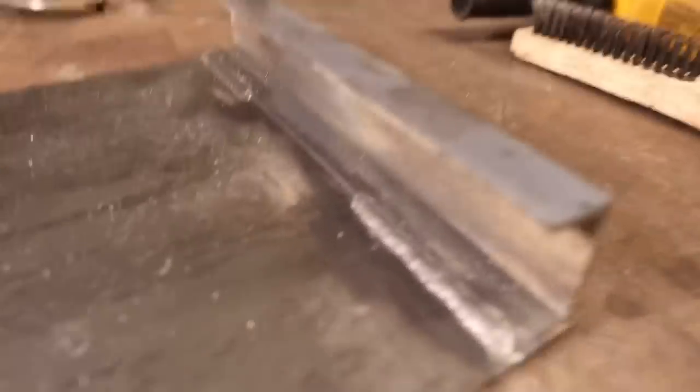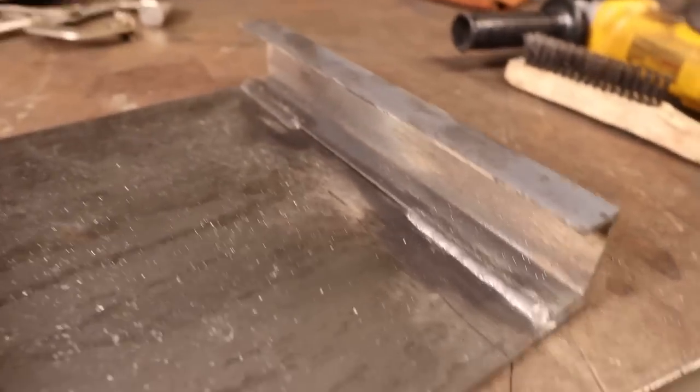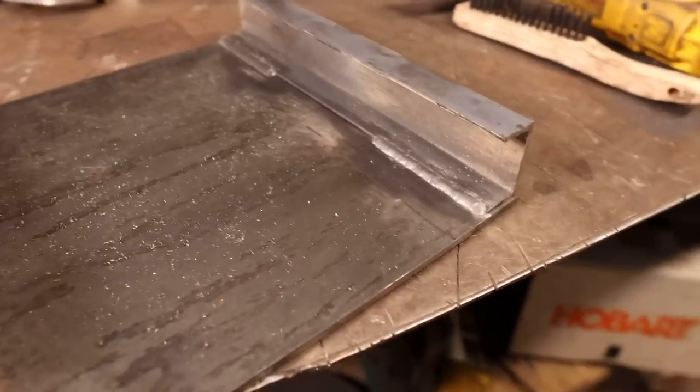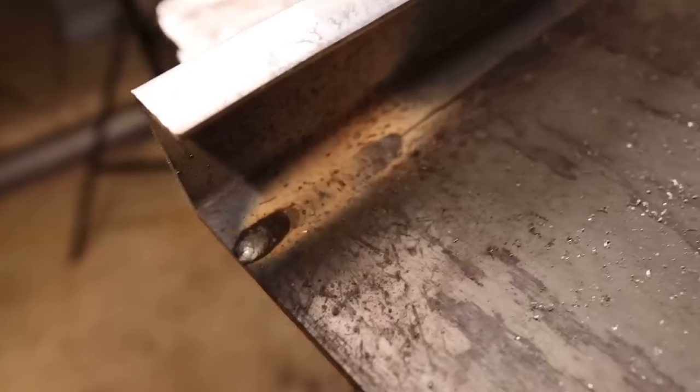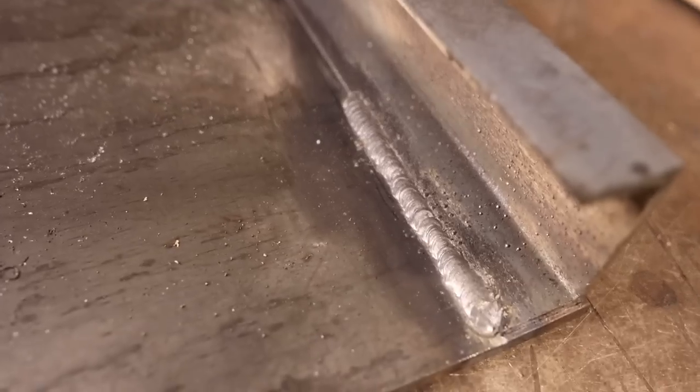To get things started on this tortilla press, I took some 2-inch steel channel. This is some 11-gauge 2-inch channel, and that's the feet of the tortilla press. I like that it's nice and wide so it can sit on any burner or hover over the burner itself, depending on what kind of grates you have. And I'm still using the same little flux-cored MIG welder, Hobart 140. It's been going strong for the last few years — highly recommend it. It is flux core so it's a super dirty weld, really smoky and sputtery, not too pretty, but with the help of a wire brush or wire brush angle grinder attachment, it cleans up pretty nicely.